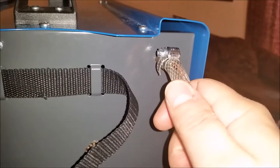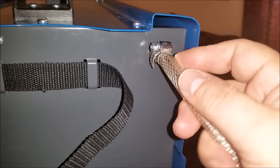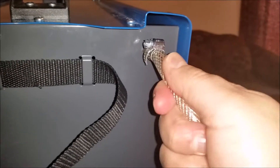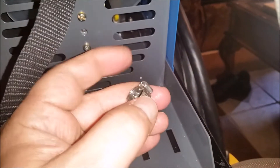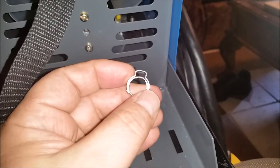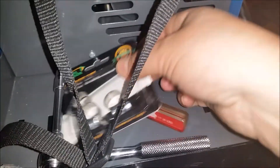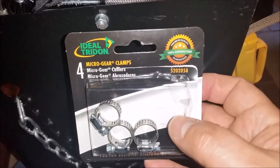We had this hose on here and it's just a press-on with some serrated nipples, and it was too loose. You could just move it side to side and back out a little bit, and I knew it was gonna leak. Harbor Freight came with this little clamp on it, which was pretty inefficient, so I went down to the auto parts store and bought some number four clamps.